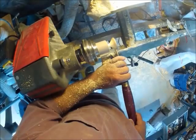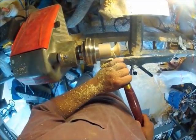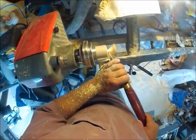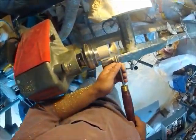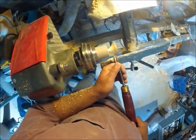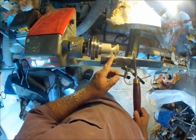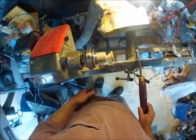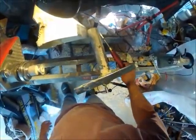What I do is I usually try to turn, get in the harmonics — see there's some flex — and it's going to leave a little ridge there, but I try to make this very top around a quarter of an inch. I'm getting ridging and chatter because of the harmonics. So I think we're done with that guy.